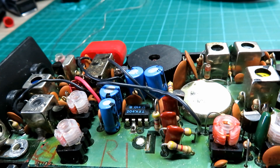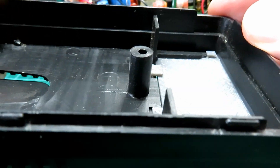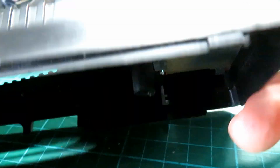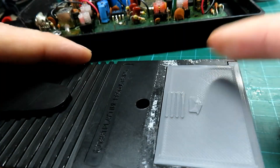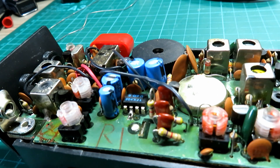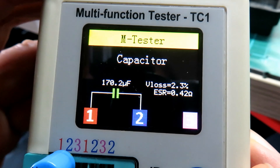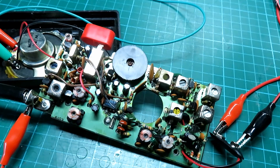We'll look at just aligning these on the equipment to get them as good as we can. I must say I'm rather pleased with how the battery cover has come out — I've managed to design it so it clips in exactly the same locations on the underside. We could have printed some text on there, but it just shows how good these 3D printers can be when set up correctly. Let's flip this over and get those capacitors changed. The Tronicon capacitor — the first one I pulled out — reading 170, so that's well on its way. Definitely worth changing.